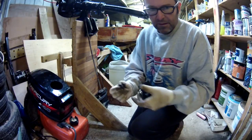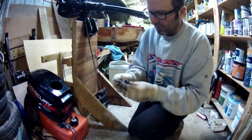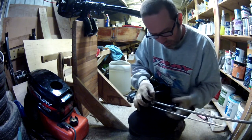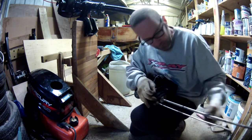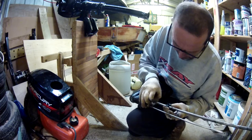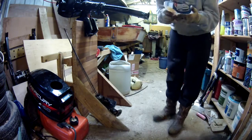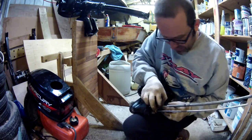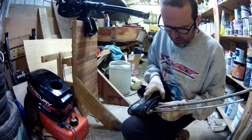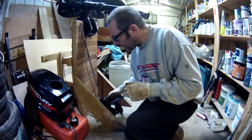The easy way would be to put the impeller into the volute first, but that doesn't look like it's going to work, so let's try the more normal way. I'll just slide it onto the shaft here — there's the keyway just up the top. Unfortunately the keyway doesn't neatly line up with one of the impeller vanes, so you're kind of guessing, but it's gone on.